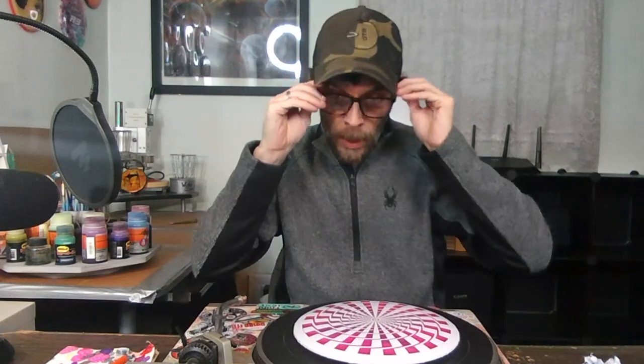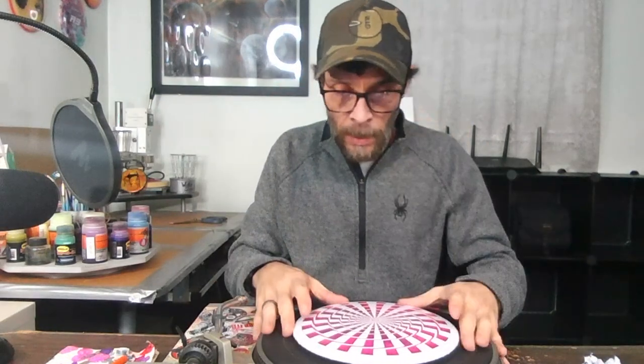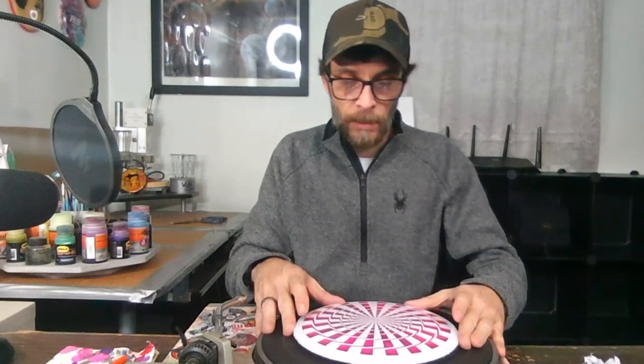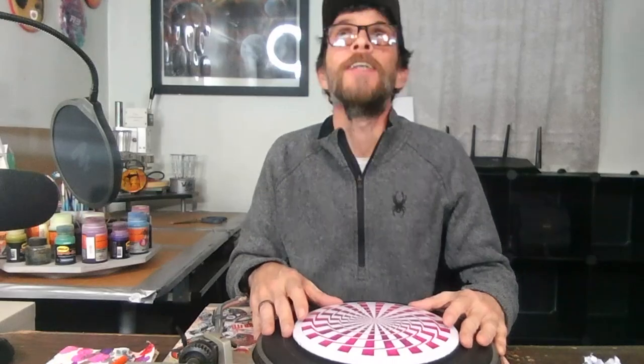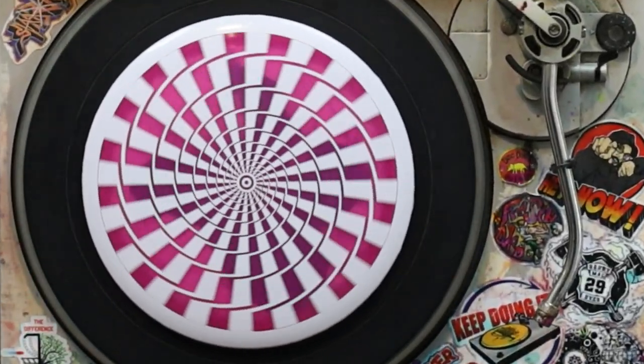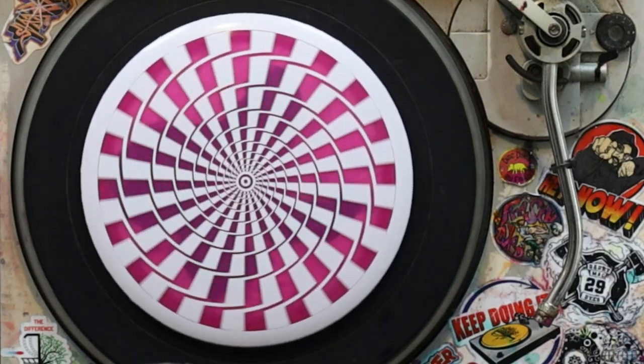In the areas where this is most susceptible to bleeding, we did pretty good wrapping it, so I'm not concerned about wrinkles coming up to the edge. I can see the old impression of the old stamp — there's a little bit of embossment to it. So I want to make sure the vinyl where it's in contact with the old stamp is pressed down really good. I'm going to go over those areas extra now with the back of my thumbnail trying to rub it in. That should be good. Now I'm going to tear this place down and set it up for a hot dip. We're going to hot dip this part we just weeded out black.